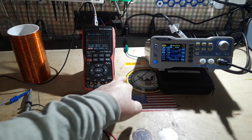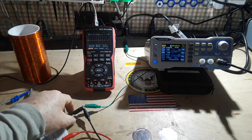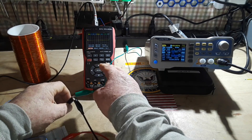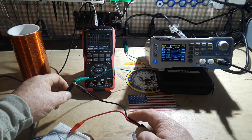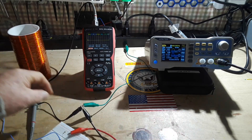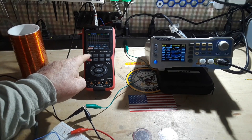So what we need to do is we need a ground. For my ground I'm simply using this green wire here that is connected to a screw on that power strip, which I tested and goes to ground. So there are my grounding points: green goes to the earth ground, this is the ground from the signal generator, and there is the oscilloscope ground.